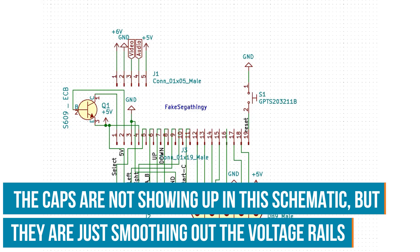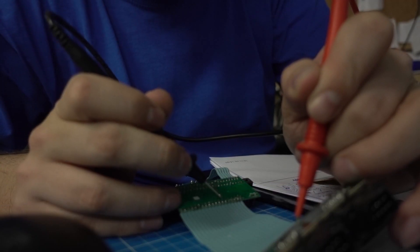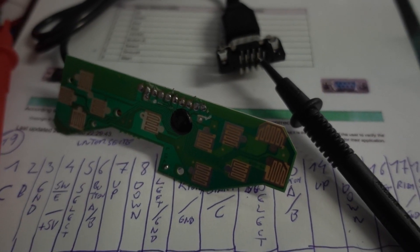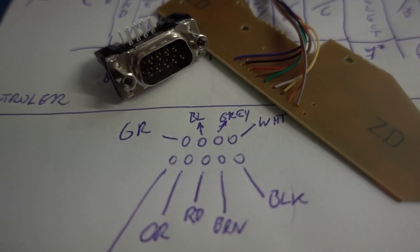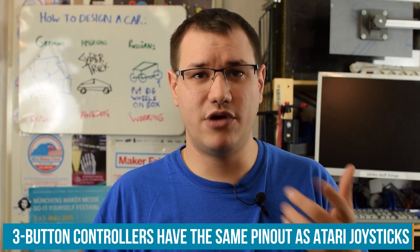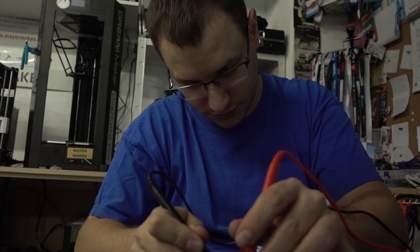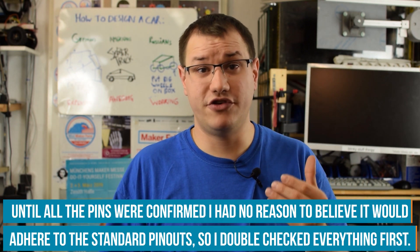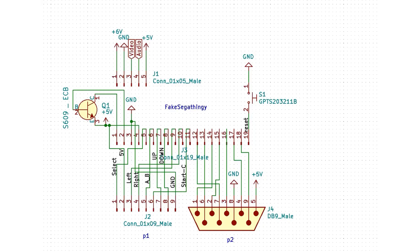You could call that reverse engineering, but it's actually just following the traces on the PCB and referencing them to the pinout of the controller inputs — these are exactly the same as on an original Sega Genesis. I confirmed that by referencing the joypad PCB to these pins and it turns out they are basically an exact clone. They also have six buttons, so the working mechanism for the six alternative buttons is also the same as the original. I want to keep two-player functionality, so there will be a DB9 port on the finished unit. I used my Klein multimeter to ping everything and confirm the correct pinout.